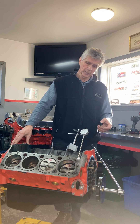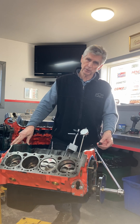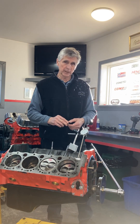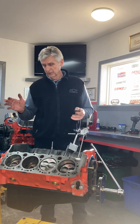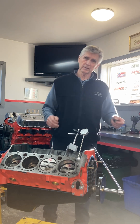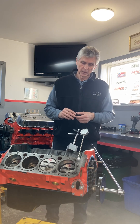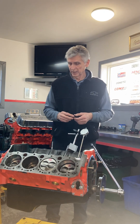Another way I could have used: you can buy water pumps that have a special adjustment screw that pushes against the timing cover as well — that's another option. If you're converting from flat tappet to a roller cam, those are things you have to think about. Even though I initially thought I had it figured out with the steel cover, it was actually that easy to flex the cover. The Cloyes cover will solve the problem — not an inexpensive solution, but it will solve the problem.